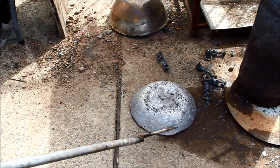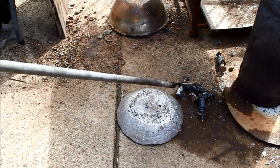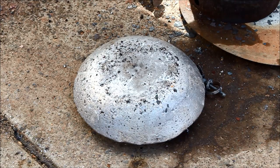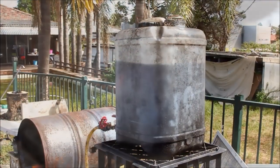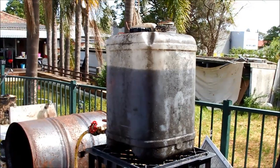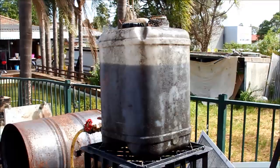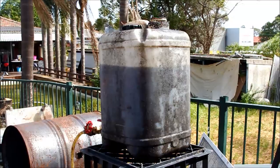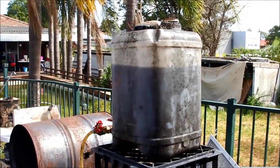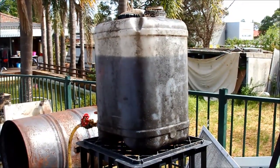If I waited about four hours I could probably get it cool enough to weigh, but you saw what this started off at — you can see what's left, so as they say, do the math. At this rate I'm going to have to start going into my own scrap metal business — I'm getting more aluminium around here than I know what to do with. People often ask me about fuel consumption on my burners. I had that drum pretty full when I started and I've probably been running the thing a good 15 minutes on low speed since I finished melting that head. That's probably four or five litres out of a 25-litre drum. You can get an awful lot done with not much fuel — even if that is a concern. I'm using free fuel: vegetable oil, waste engine oil and transmission fluid all work just as good.